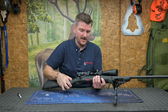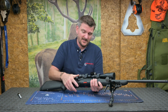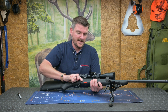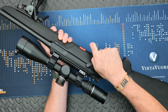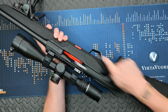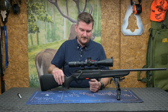Those 7 or 8 millimeters backward, when you're emptying the rifle, that is basically your primary extraction area, because you want to develop some speed in those 7 or 8 millimeters, so that when that bolt hits the cam and flicks it clockwise to open it, you've got a little bit of speed and a bit of momentum built up.